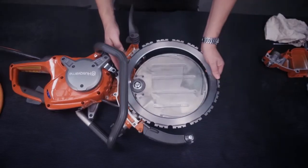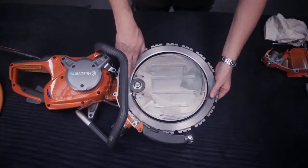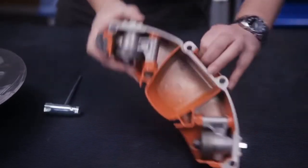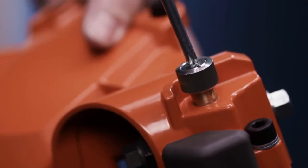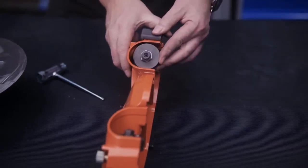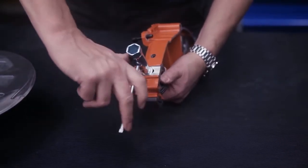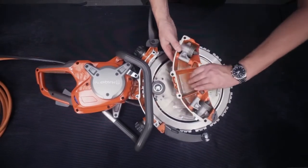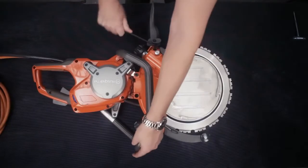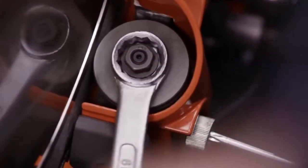Place the blade towards the engagement rollers and tighten the knob slightly to hold the blade in place. Loosen the locking nuts and unscrew the adjustment screws about one turn. Make sure that the arms for the support rollers can move freely. Press back the roller and tighten the locking nut lightly. Fit the cover and tighten the screws firmly. Once the blade has been fitted, adjust the rollers.